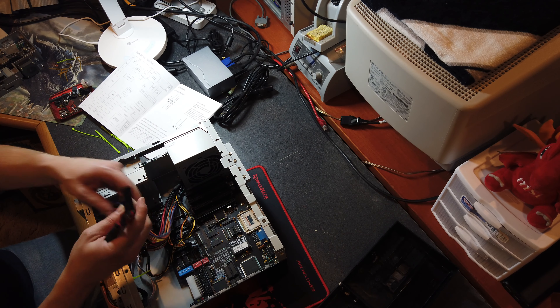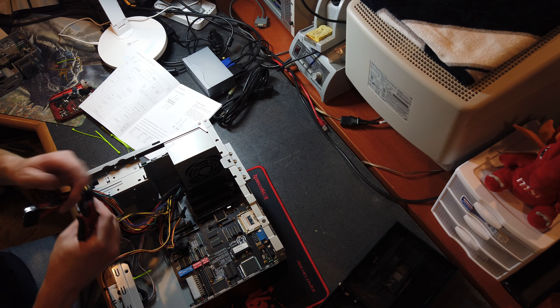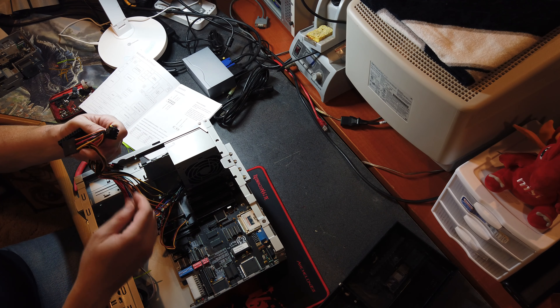So now we have our convenient little 20-pin ATX power. I really don't need any of the other connectors, although I may end up tapping off one of them to hook up the 5.25 inch floppy drive, because I believe it uses a full-size Molex. Everything else for now is just going to tuck back here out of the way. I'm hoping I can put the floppy drive right here, but we'll see.